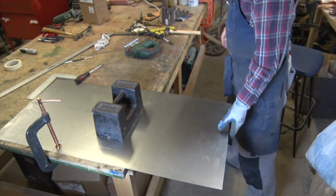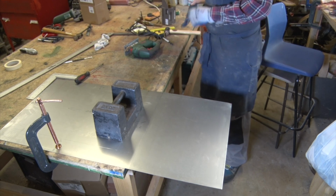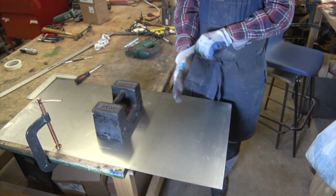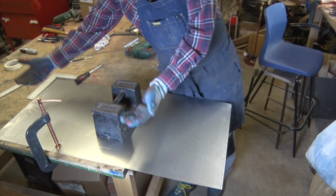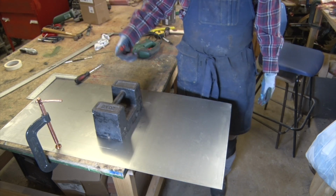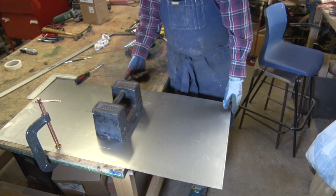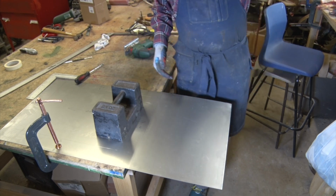So for the next piece we have to make what I'm calling the firebox. I mean it's really just a tray, but it sounds far more exciting if you call it a firebox. And what I'm going to do is I shall cut it across here, and then I'm going to bend the sides up, and I've got 75mm round 3 sides and a 50mm bend to come up on one side, and then that theoretically should do it. So I'm just going to cut along this piece first.